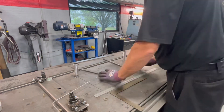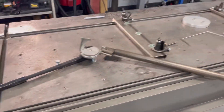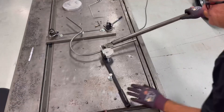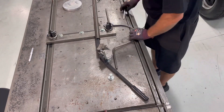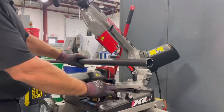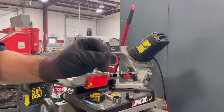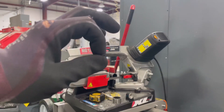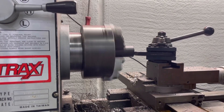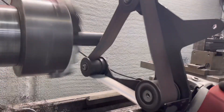It's 90 degrees on one side and about 75 on the other, so it's going to kind of look like this sitting in there. That circle represents the pulley and it's got to bend 90 degrees over each direction. This is just a rigid pipe bender for half inch, and it's all it needs to bend this 065 chromoly. They came out pretty decent, and the thing is you've got to make two of them exact. Then I'm going to make the saddles that are going to go up against the frame rails and weld to them. You've seen this before in my other videos — I just had to do a little sliver of pipe. That's how good this thing cuts. It's a Henshaw, and if you're ever going to get one, definitely get that brand. They don't give me anything to say that — I just want to see you guys get good equipment.